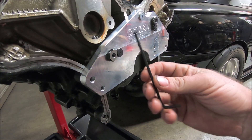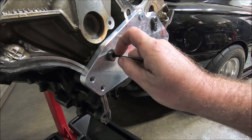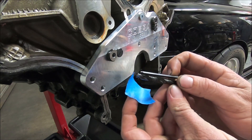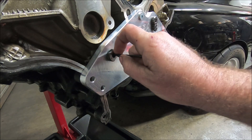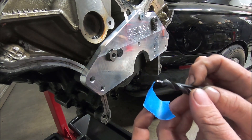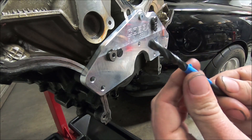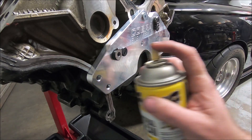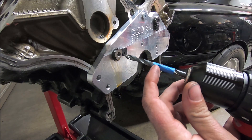The first thing you want to do is use a small allen key to figure out how deep the hole is, then transfer that depth over to your drill so you don't drill too far. Stick it all the way in and note the depth. I'm going to wrap a piece of tape around my drill bit so I know when to stop. Spray some PB Blaster in there, then drill until it gets to the tape.